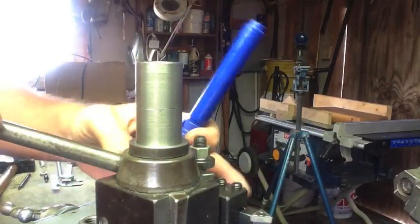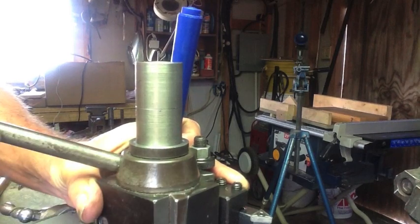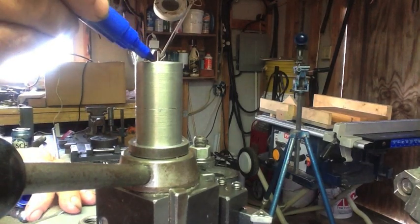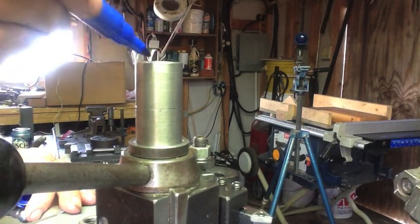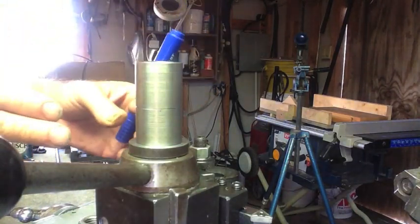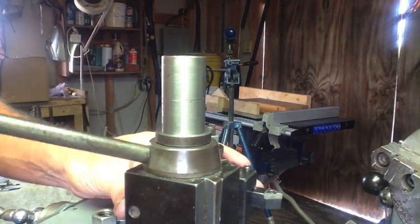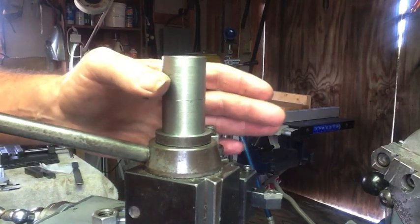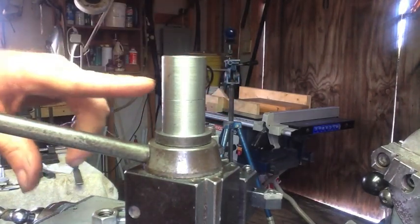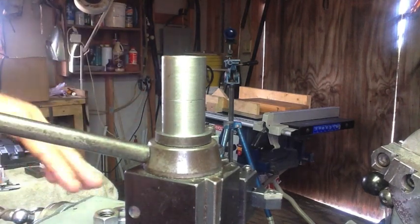To determine handle placement, I have the screw down to where the tool post is relatively tight. The existing handle sweeps from about two o'clock to four o'clock, so I'd like mine to follow the same path - marking the top at roughly two o'clock so when I tighten the nut, the handle swings around to my right. Ideally I'd like an angled handle, but without a milling machine I'll drill straight in and bend the shaft to match the angle if needed.